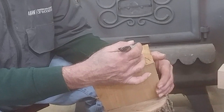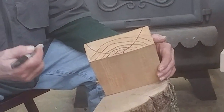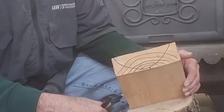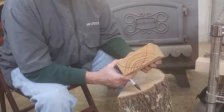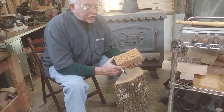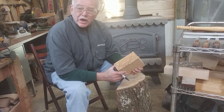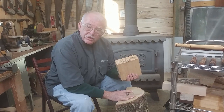Now, I could take this piece of dry wood and orient it so my bowl would be cut out one way, or I could put it around the other way where the mouth of the bowl would be down where the pith is. Let's talk about this dry piece of wood as far as the turning. One thing about turning the dry piece of wood — it's harder because it's dried out more, so it's going to be harder to turn than your wet wood.